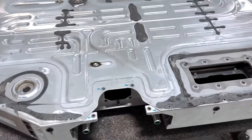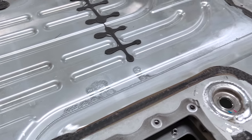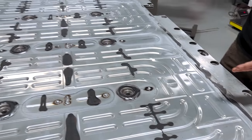This is a two-piece stamped and brazed aluminum plate that is friction stir welded around the perimeter to the pack frame. It flows the coolant — the ethylene glycol — in a serpentine path across the pack and then back out.